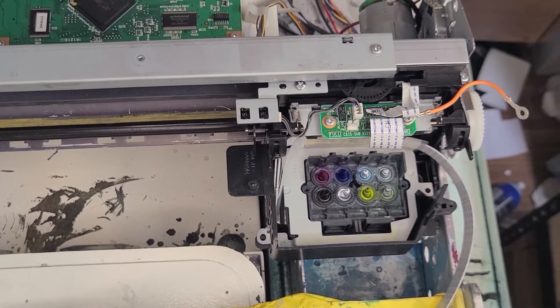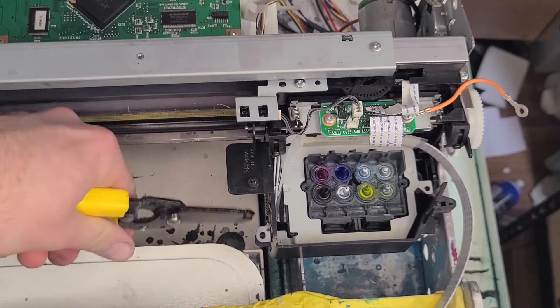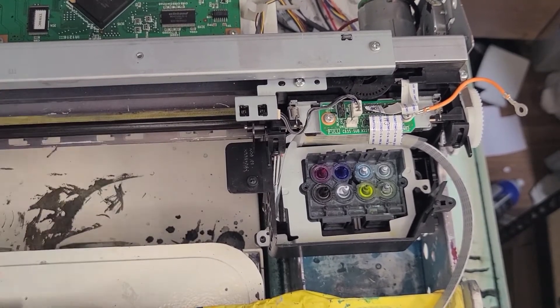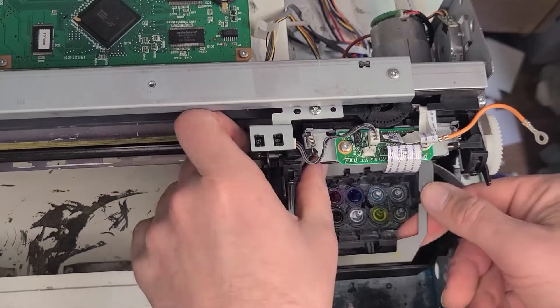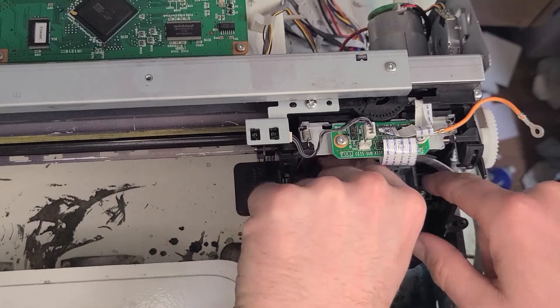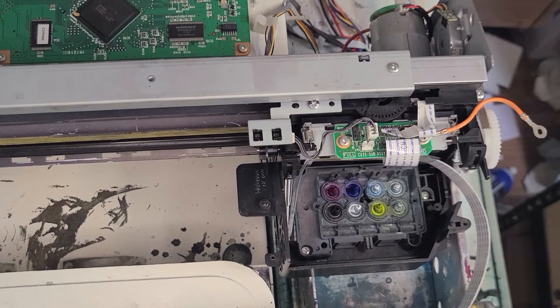I like to use a small pair of pliers that I normally have right in front of me, but at the moment they are not there. So we'll just unclip this little spring — don't lose it. Then you can slide out this metal top piece. It does come out like so. Also from here, our printhead is removable. Three screws to remove the printhead.